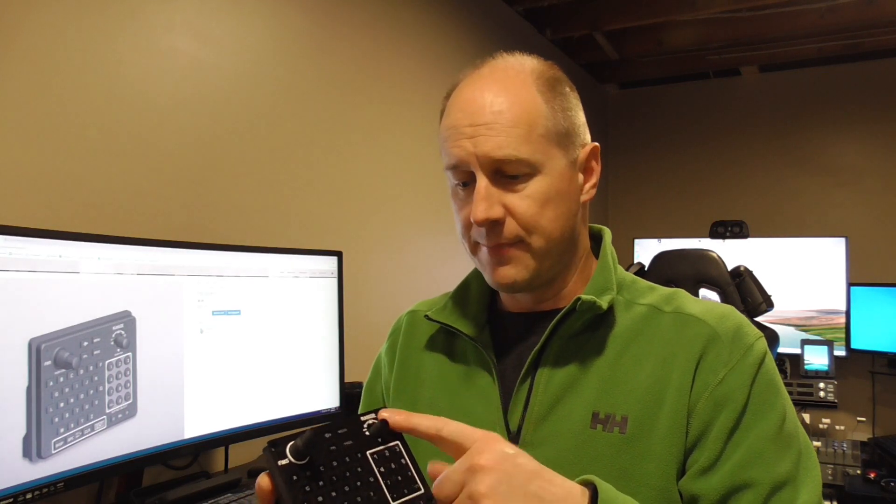This also uses the same map control switch — that little four-way micro joystick with the rotary and a push. They are like $25 on eBay. It's only one place I've been able to find that has them in stock and they kind of have the market cornered. If you do find them at Digi-Key or Electrosonic, Digi-Key required buying a hundred with a 22-week lead time, and Electrosonic required buying five or six with a 23 or 24-week lead time. So just buy them on eBay — spend the $25 and you'll have it in about six weeks. The FMS dual rotary encoder with the push button is the exact same one used on the G1000, so if you need five for the G1000, just throw an extra one in.